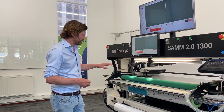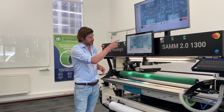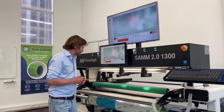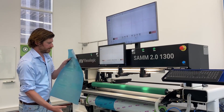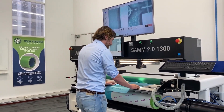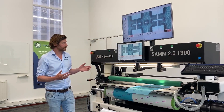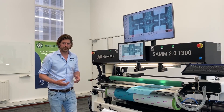After the plate is mounted, the pressure roller goes up. You'll see it does a quality check — it actually measures the position, gives the okay to the operator, and then goes to the next plate. I've got the next plate on top of the machine prepared. I only have to put it in the field of view — very quick, very easy. You'll see it recognizes the mounting marks, starts positioning, and when it's in position, completes the process fully automatically.